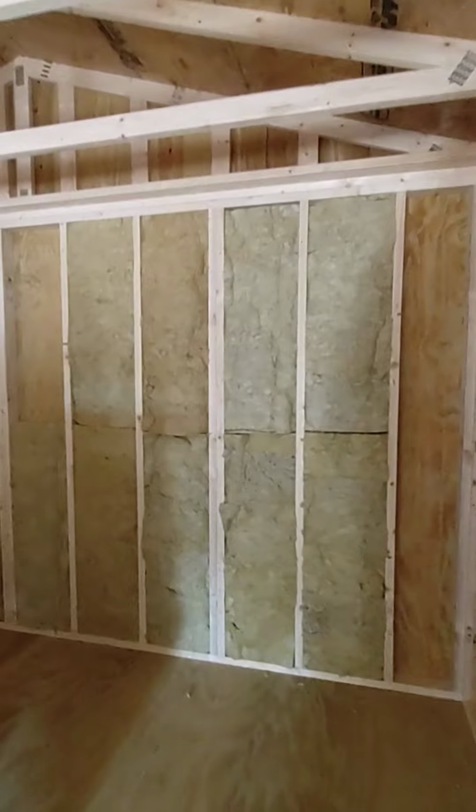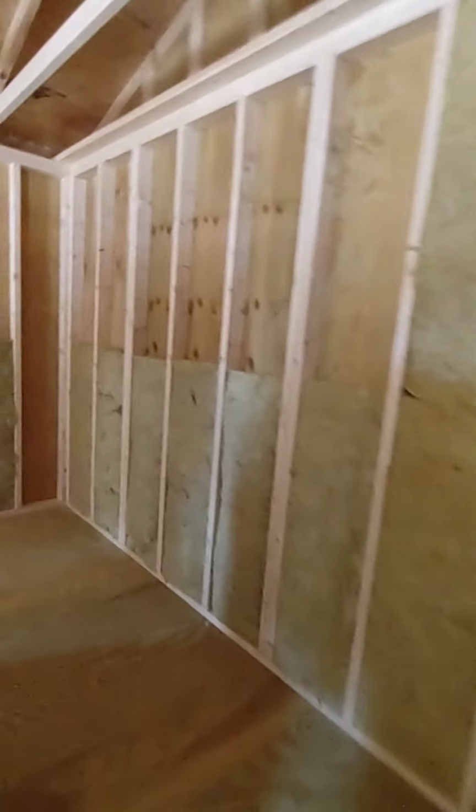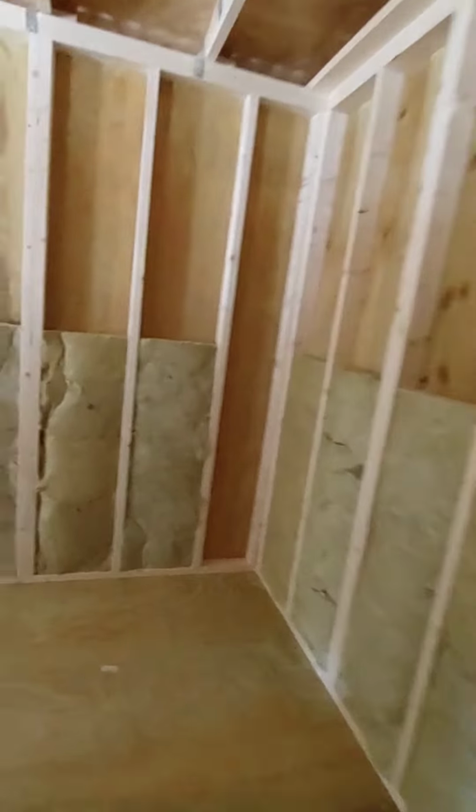Okay, you guys, I'm all suited up and ready to get this going, so let's see how long this takes me. All right, it's 1:45, you guys. It's coming along. I've used just a little under half the insulation for the walls. For the tops, I gotta cut them down to size, and I've been using a serrated knife, that's the best thing, and taking my pieces and putting them in between the cracks in the walls over there to fill the voids. That's still a shuffling process, but it's coming along, as you can see.